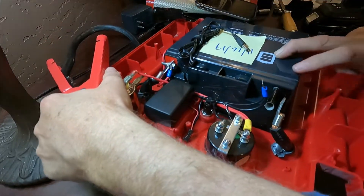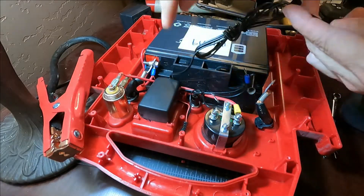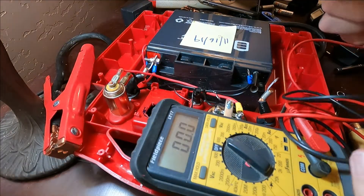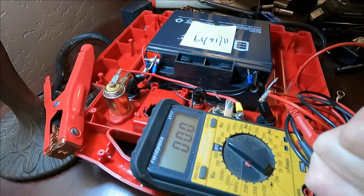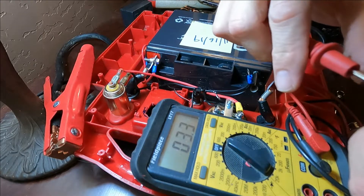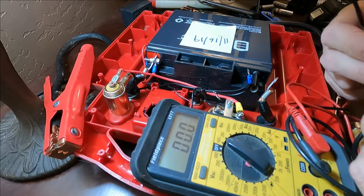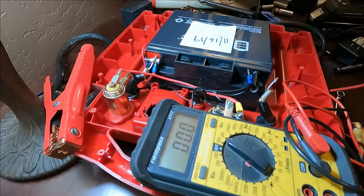I'm going to put the bracket on anyway in case it gets dropped again like last time. So now I'm going to clip these wires, plug this into an outlet, and make sure I know which one is positive. I'll touch the bare leads to my voltmeter — running them one direction I get positive voltage close to 12 volts, and if I switch them I get a negative voltage. That shows me the first way I had it is the positive attached to the red lead on my multimeter.